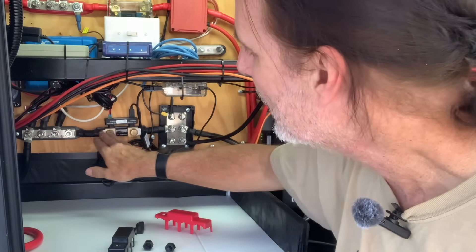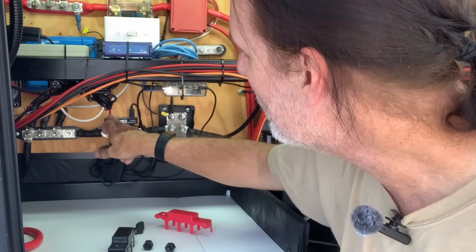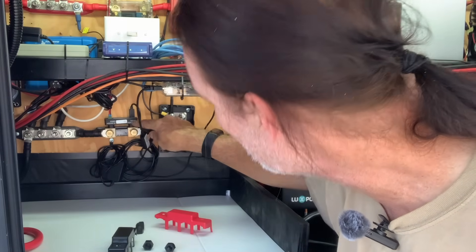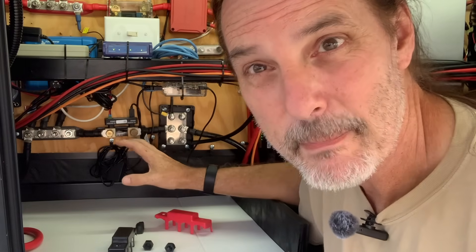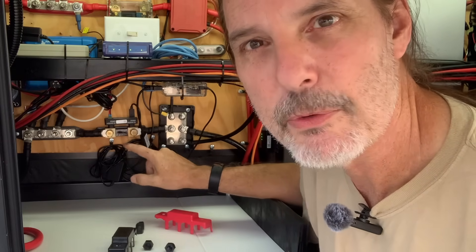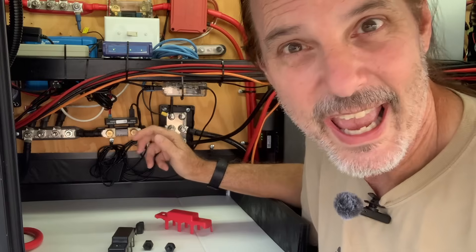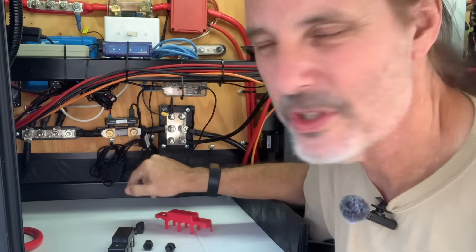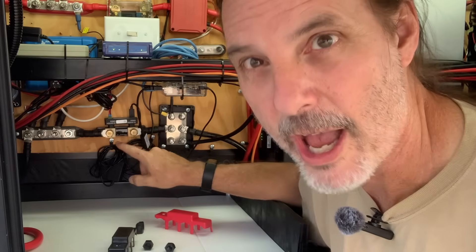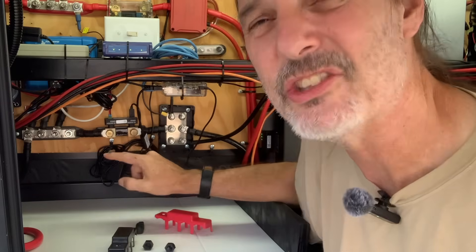Setup is very easy. Connecting the wires on both sides — if you choose to add a thermometer you can; if you only use Bluetooth you don't need the extra wires on top. You basically hook up the positive and negative connection to power it and that's pretty much it. If you're going to have any type of off-grid setup using batteries where you want real state-of-charge accuracy across more than one battery, this is what you need. Check the links below, and if you can use one of my affiliate links that helps, but more importantly, this is my trusted go-to device for knowing exactly how much fuel is in my tank.